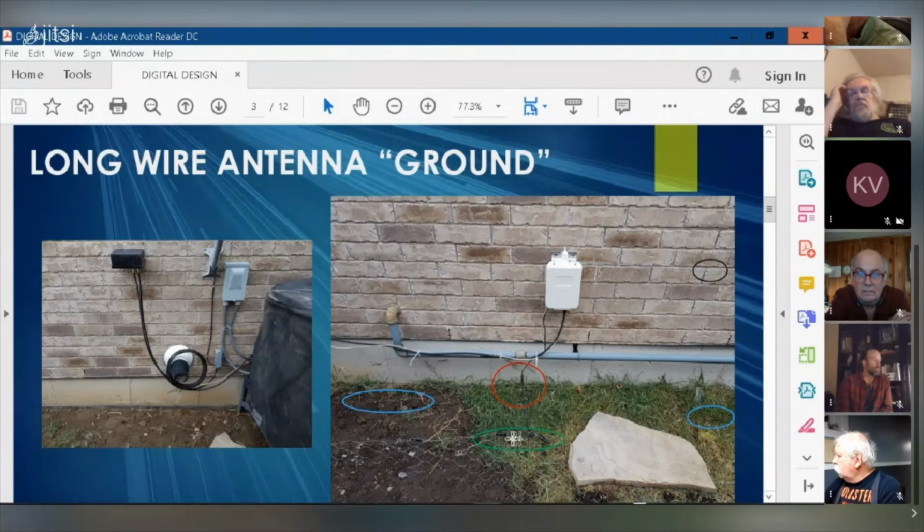And here you could see the attachment where I've got it attached to the chicken wire mesh. And I've also got a copper wire run along the entire distance of the mesh. And I've got it soldered to various places just to make sure it's completely connected together, because it's about three sections of mesh, and where the mesh overlaps, eventually in time, that's going to corrode. So I decided to solder this copper wire to it, and then the black things are coax seal I put so that the solder joint doesn't corrode.